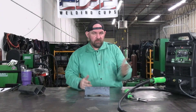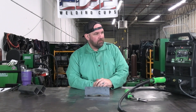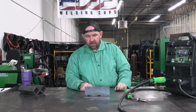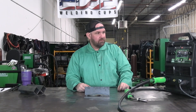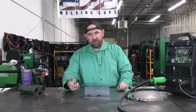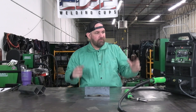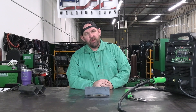This was a short and sweet overview of some of the hard wire settings on the new 253 DPI. The upgraded LCD menu makes it a lot easier to know what you're adjusting, and the addition of the power set mode makes it super easy — we didn't really have to touch much except a little bit on the pulse just to dial in the arc length. Super clean runs. Basically a beginner setup: press one button, a little bit of dialing in, and you're up and running on spray arc on eighth inch mild steel. If you're looking for a super powerful professional-grade single and dual pulse MIG machine for steel or aluminum, check out the 253 DPI with the new LCD menu. I'm Jesse McCollum — thanks for watching, we'll see you guys soon.